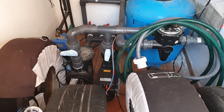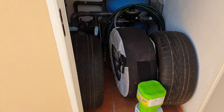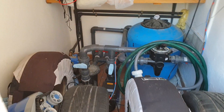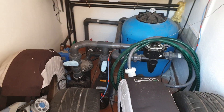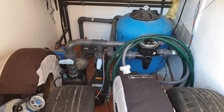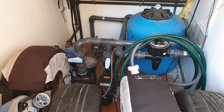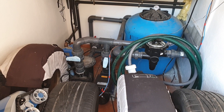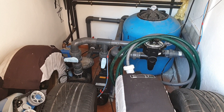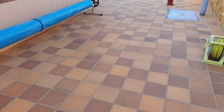The AC pump is turned off so the water doesn't go through it — only the solar pump is on, working at full speed. It's quarter to three in the afternoon. Originally when I bought the pump, the vendor recommended 250 watt panels, but since I didn't have enough space I preferred three 310 watt panels instead, and it works absolutely fine. I'm saving a lot of money on energy — instead of running from the grid, it runs directly on energy from the sun.